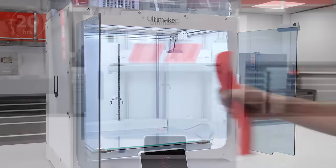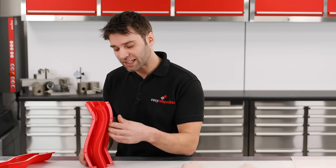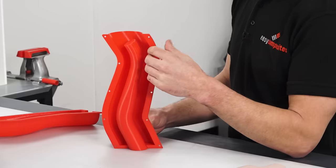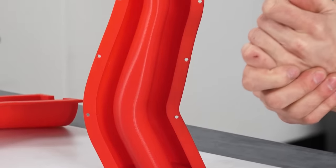However you've made your pattern, the next step is to create the mould. We can use silicone rubber because the low melting point of these alloys and the relatively high service temperature of silicone — over 200 degrees C — makes it absolutely ideal. To make a silicone mould, the first stage is to create some barriers or dams around your component. In the case of the 3D printed part, I've taken the opportunity to print these barriers at the same time, so they can simply be bolted around the pattern, leaving a very consistent cavity to pour our silicone into. The offset I've got here is 20mm, and I would recommend a wall thickness on your silicone of around 20mm for most applications.